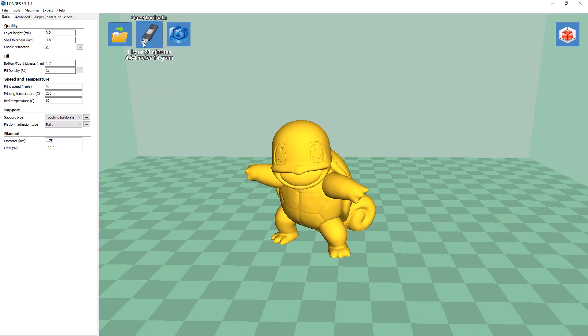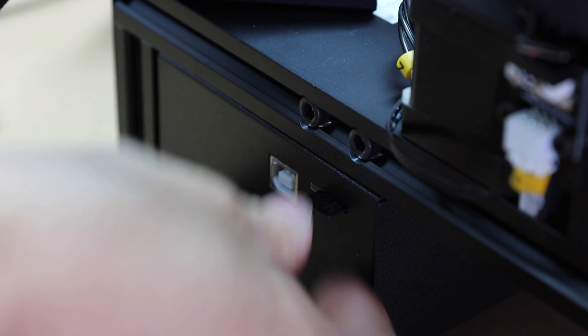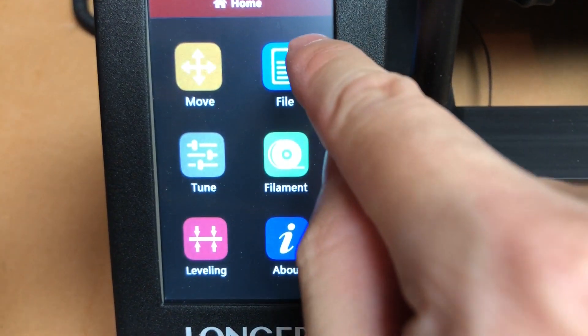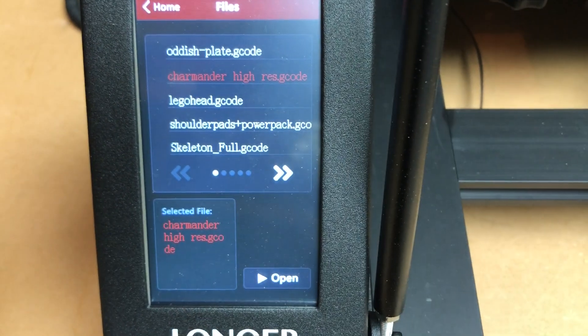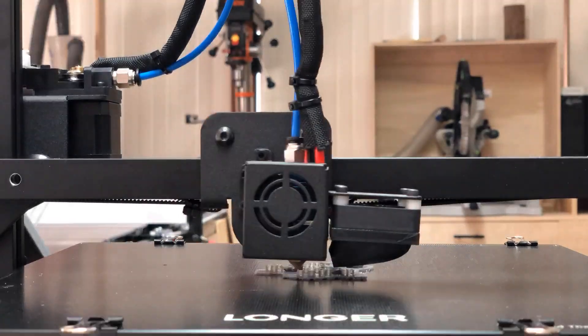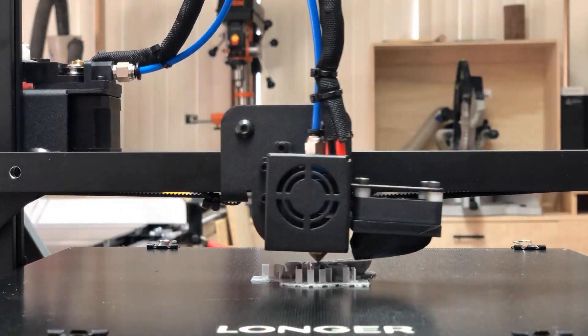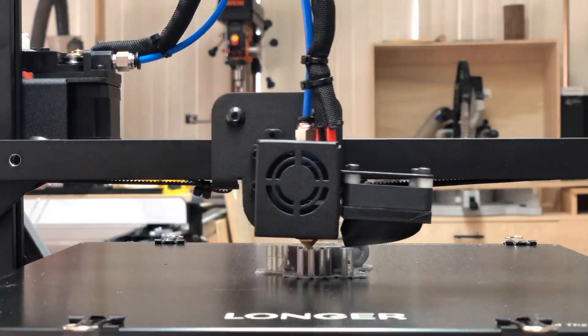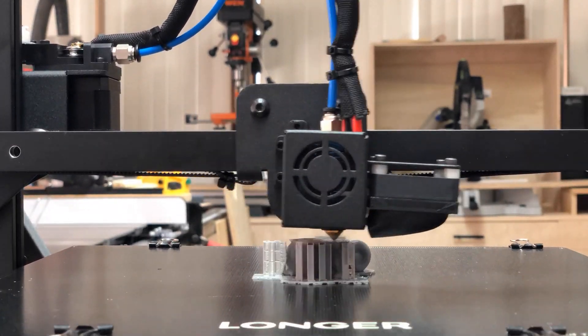Finally, when you are ready, you can click this USB button to export the G-code to the micro SD card included with the printer. Plug in the card and we can start our print. Now as you start the print job, you will notice that initially the printer just sits there and does nothing. This is expected, as during this time the printer is heating up the nozzle and the heat pad. As soon as both the nozzle and heat pad reach their set temperature, the print will begin.